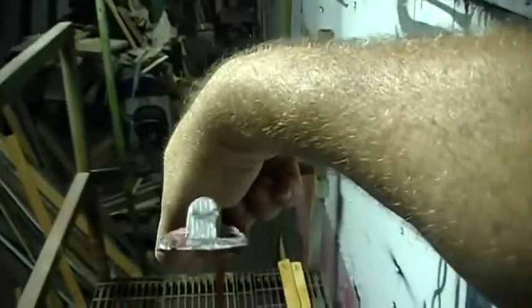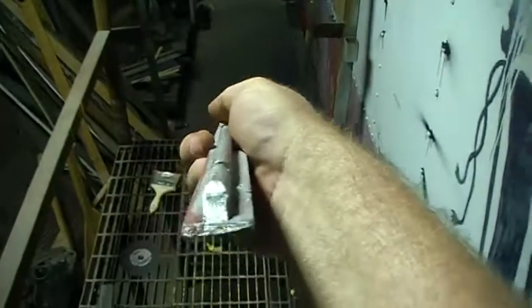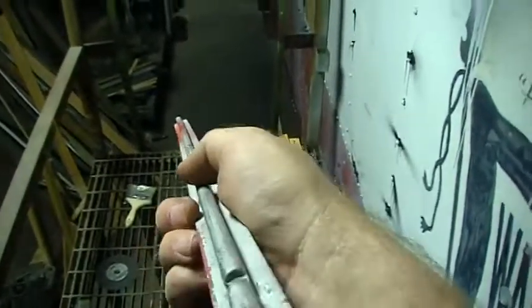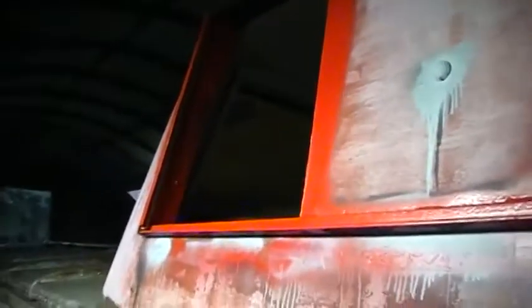Here's a cross-section of this aluminum window track — it's made by Adams and Westlake from Indiana. I have the original Wabash Ann Arbor plans, so I'll post that on the Wabash Caboose Owners group. If this track breaks when you take it out, no sweat, because Adams and Westlake is really good about working with railroad museums and historical societies — they can pull the original plans out of the drawer and make you new parts. That's essentially how you get these windows out.